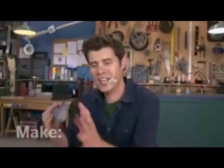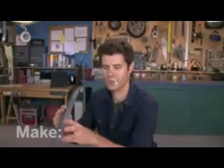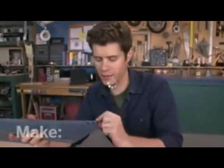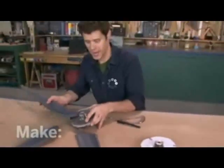All right, after a good bit of sanding, I've got a nice wing shape on all 3 blades, including this really sharp trailing edge. Now, I need a way to attach the blades to the flywheel, so I've drilled 2 holes into the end of each blade for a 1/4 inch bolt, and I'm going to need to drill and tap the flywheels to attach them.